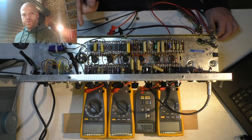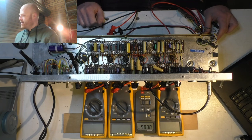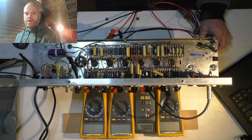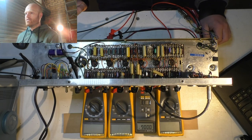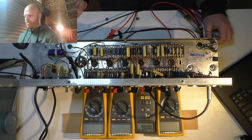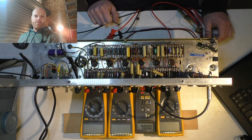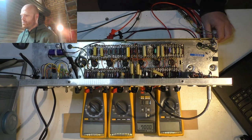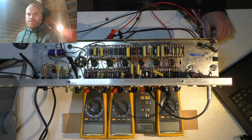So I used the dual section can caps, which you can get almost anywhere, even in Australia, believe it or not. And then I've just used some garden variety axials in there as well, which again you can find pretty much anywhere. They're Nichicon, 450 volt rated. Just tested it on full voltage and they're only pushing 250 odd, so massively overrated. Even the dual can caps are 500 volt, but they're pushing 350 max, maybe 400, when you first start it up before the tubes conduct. So I probably could have done with 450s there, but whatever.